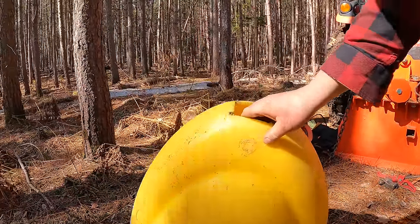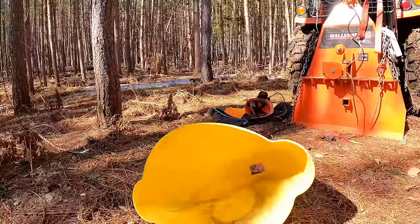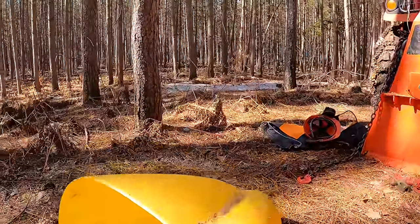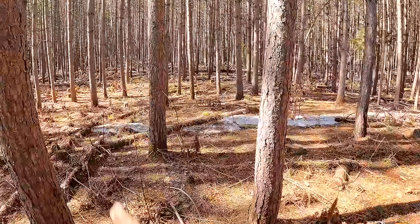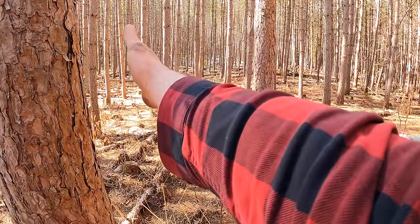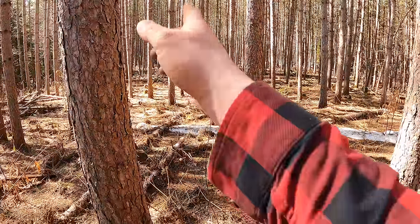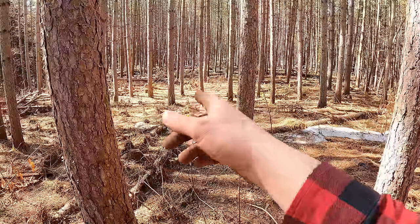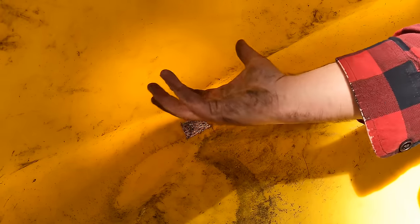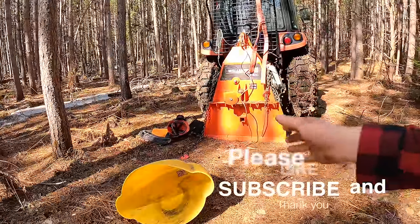I've had this nose cone for a number of years. I don't use it all the time, but in certain circumstances it's very valuable. Going back to the same example: if I ran the winch line through here and hooked onto a log trying to pull it through a narrow spot, the likelihood of that log getting hung up on a tree or stump is high. By running the winch line through the nose cone opening, the logs sit in it and it allows them to maneuver around objects.